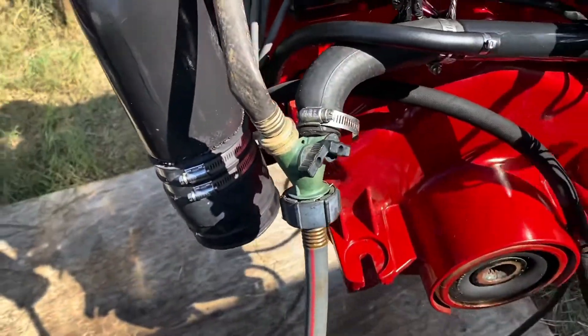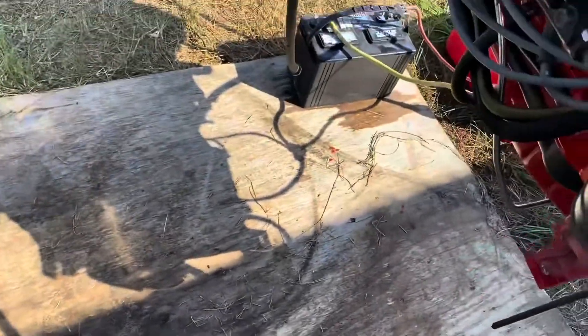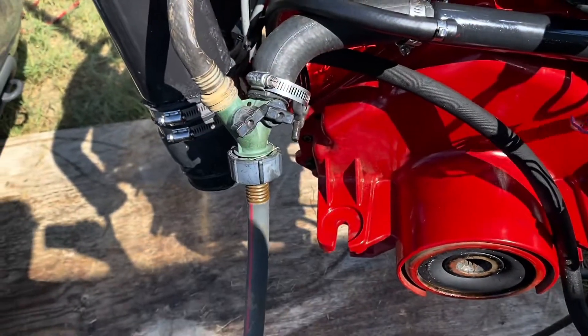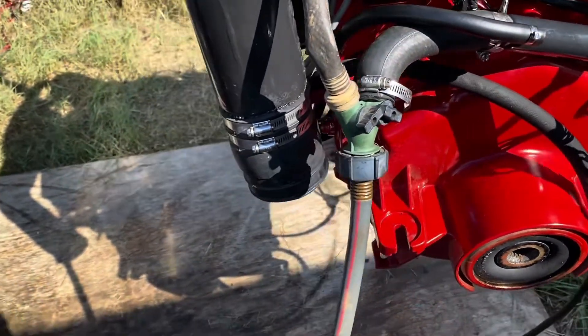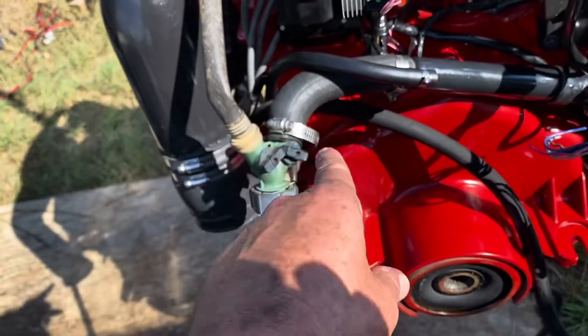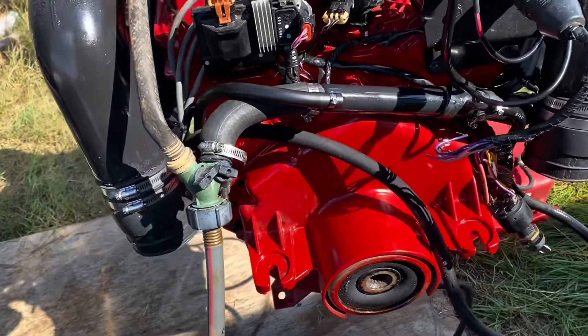What I had to do is use this three-way device here. I've got this extra garden hose running off to the side, so when I turn the water on I just let that bleed off the excess pressure, and then I slowly open that to get water to the engine and make sure it doesn't leak out front. Once the engine is running I'll crack that open further so it can suck more water in. But that's not what this video is about.